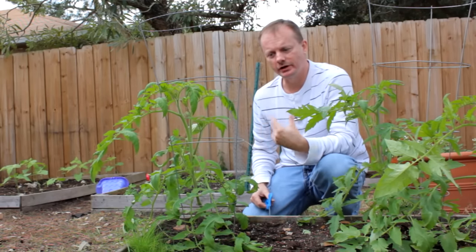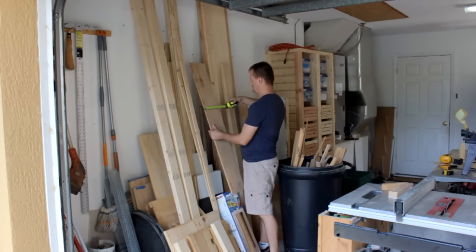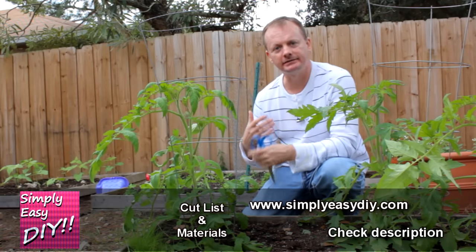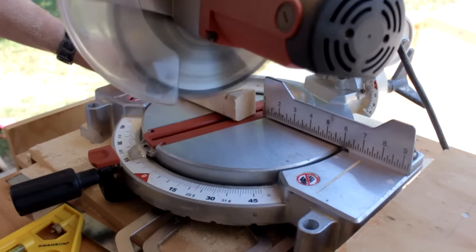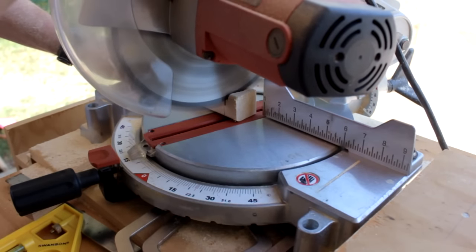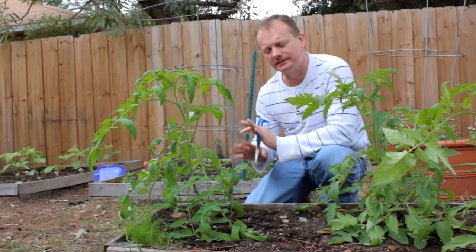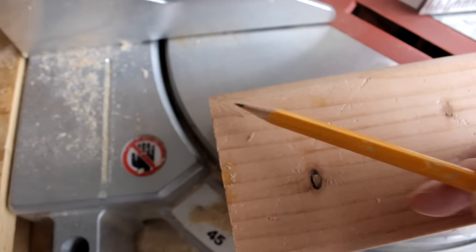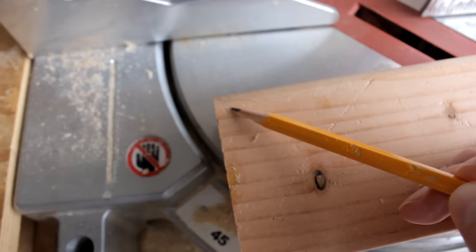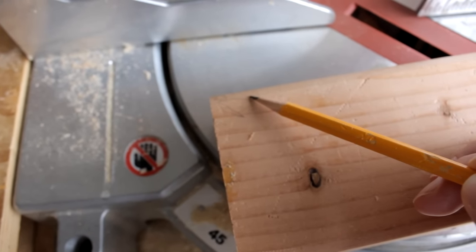The first thing I do is find a board suitable for my project, and here is where a lot of new people run into their first sticking point. Often they are using plans from the internet or a magazine and they go top to bottom on the cut list, cutting all their boards to length first. Then they take those boards already cut to length and try to cut the angles into them. All that does is force you into a situation where you have to be extremely accurate — you have to find the exact corner of a board to make your cut. Cut too far one way and you get a poor result; cut too far the other way and you have just cut your board too short.